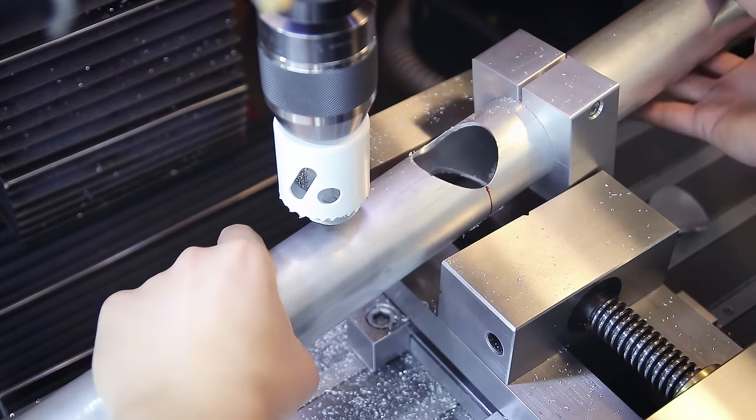After a bit of cleanup the fit is looking great, so I'll move on to one of the trickiest cuts so far. I now need to cut this very steep miter into the end of the downtube to accept the front steering tube. I drew the rough outline of the cut onto the tubing, but I'm not using those sketch lines to line up the cut — it's really just a visual aid. Like the last few times, I first clamp the part lightly and then use the miter gauge and some gentle taps with a plastic hammer to get it to the right angle.